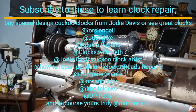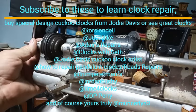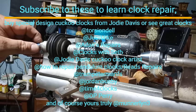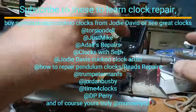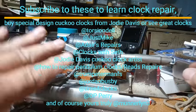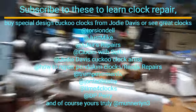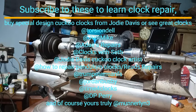But if I turn the power on, that wobbles, and that's because this needs to have a nut and a collar on the inside, just like I did with these, where I put the bolt and then the insert to get it dead center. That's what needs to happen to the headstock. If I bought the right Jacob's chuck, I wouldn't be having any of these issues, because I've already bought the bolts that will fit in the headstock, etc., etc.